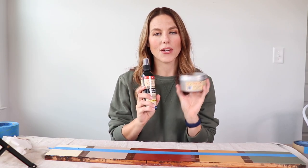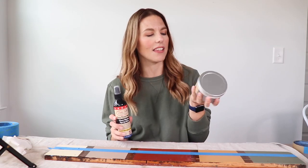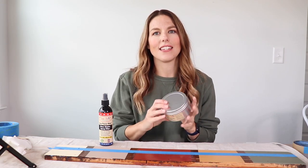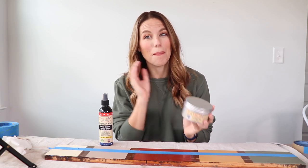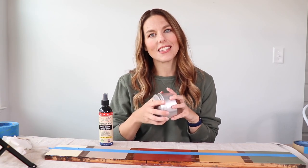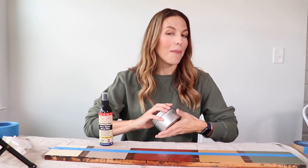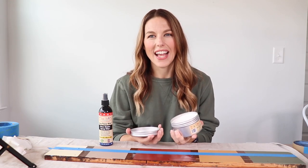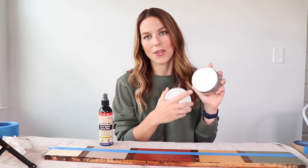Next, let's talk about waxes. Dixie Belle has two wax options — the Easy Peasy Spray Wax, and the solid Best Dang Wax, which is clear even though it looks white. The reason I like to use waxes is because you are not going to have any streaks — it absorbs right into the paint. It's a very cohesive, matte finish, which I love, but it can be a little tricky getting it on evenly since you have to buff it back. It takes a little more elbow grease and not everybody likes a wax finish. You do have to re-wax probably down the road one or two years from now. Some people just like to clear coat and move on, but I really love wax. It's a beautiful finish. It also is not going to haze your piece at all — with clear coats on darker colors you can get a weird haze or little fibers stuck in it, but with wax you can pick and buff those out.